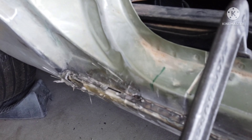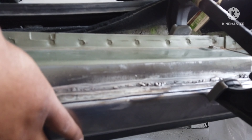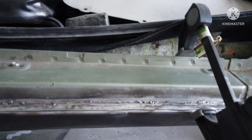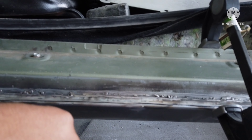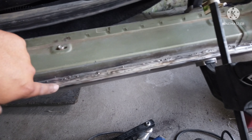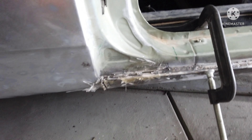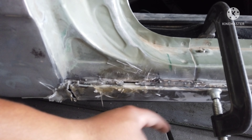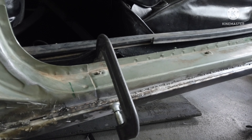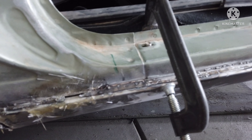Let's clean it up a little bit, try to sand that down — see how fast that goes. If not, just a couple passes with the flap disc. That's the plan. Just have this holding it into place for now. I didn't cut the bottom because I thought the bottom was good — it's going to help me out a little bit. This rocker is definitely getting some body filler. I'm going to get the welder out and just throw tack welds on these all the way around and see how well it goes. These clamps came in handy — I'm just trying to tuck it under this edge.